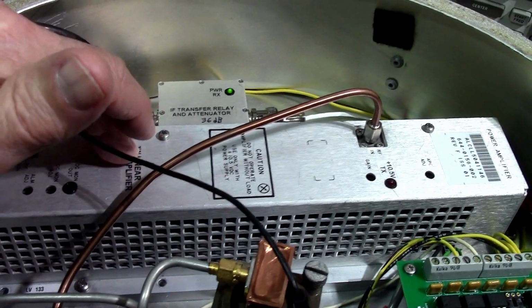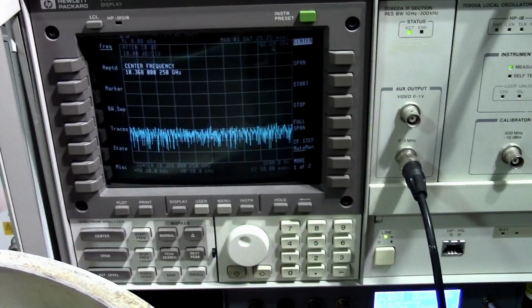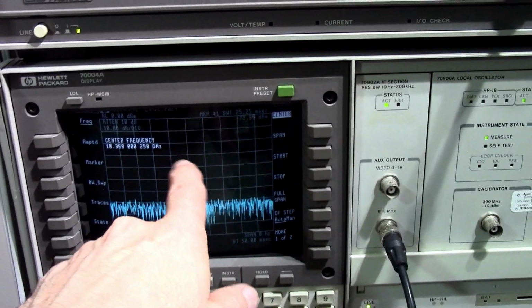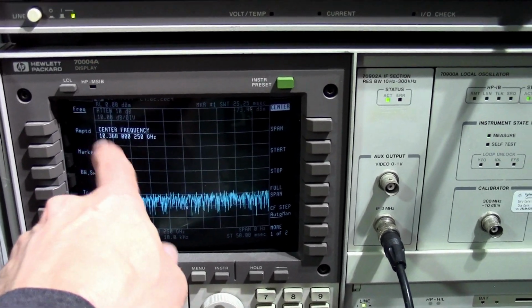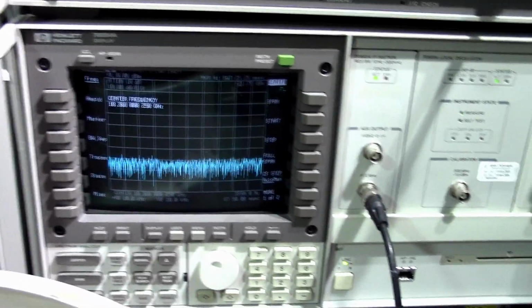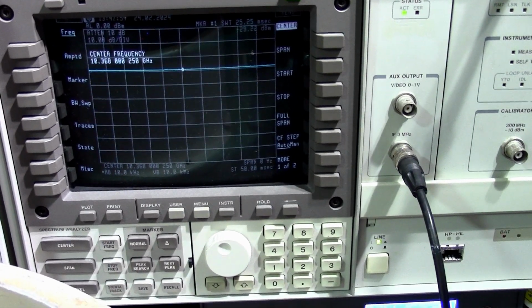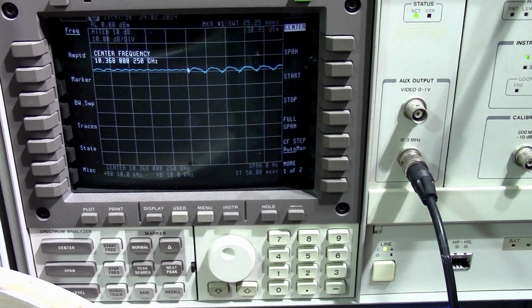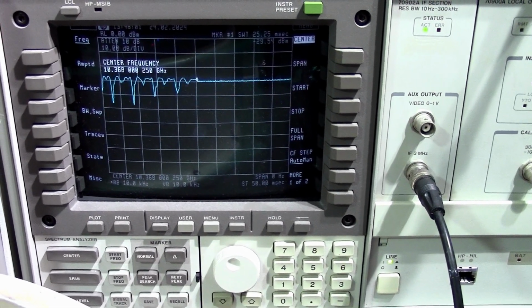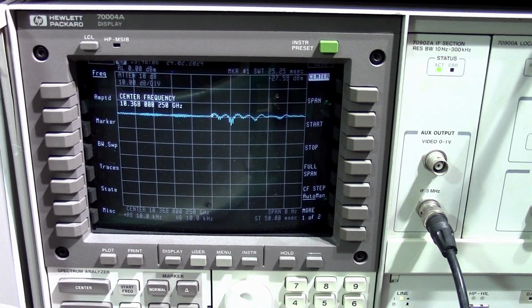So that's why I noticed that I had way too much gain, which means that in AM, I had my full power out, and when I modulated, it sounded super distorted and there was no movement on the screen. Let me show you what a better AM, or I'll say a decent AM, acceptable AM is. And here it is. You can see there's some swing above and there's some swing below. There's more swing below than above. No wonder there may be some saturation on one of the two sides.